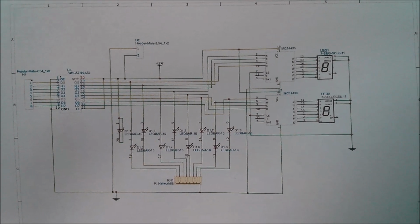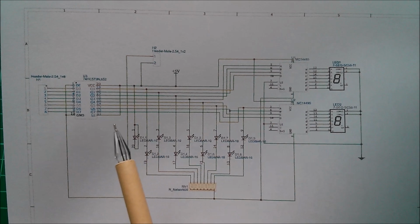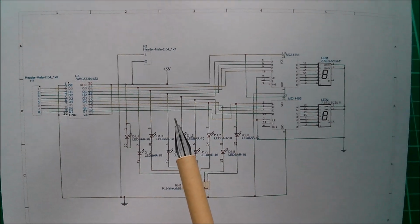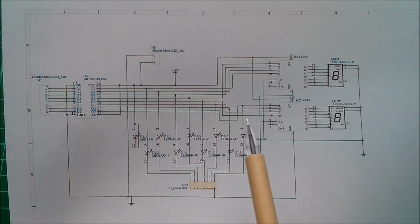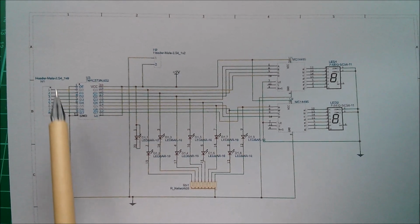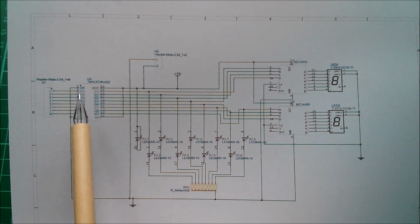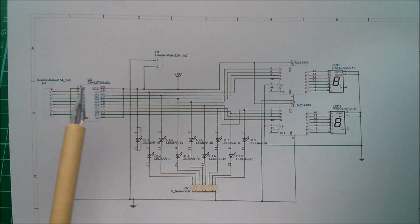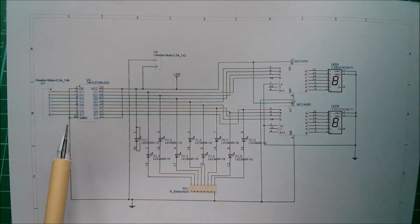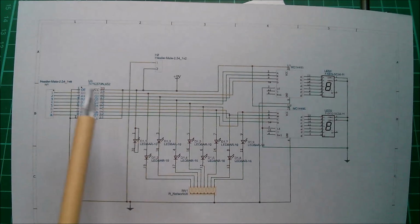Well, here's the schematic, which I said I'd print, but the print is pretty awful because the colours on this printer don't get used much, and so the heads all block up. But here we have the binary input, 8 bits. Here's the buffer that just presents one load to the input. There's output enable pulled low to enable it. There's latch enable pulled high. I hope I've got this right.